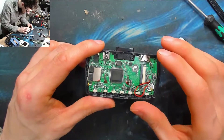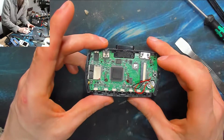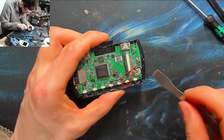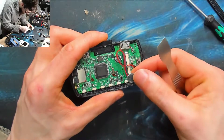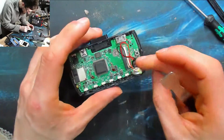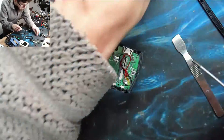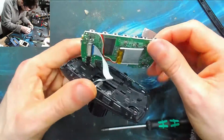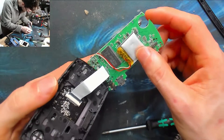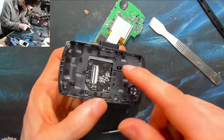The LiPo cell is behind this circuit board, so the main board needs to come out. We've got the speaker there, which I'm going to just pop out — it's a tiny little speaker that does basically nothing, but fine. There's the LiPo cell; it is quite small. Oh, it does have protection on it as well — I didn't think it was going to. Let's disconnect this main board from the actual camera module.